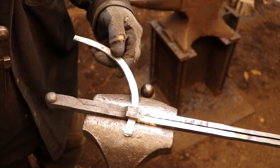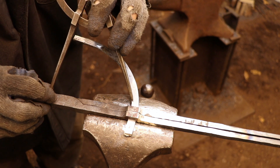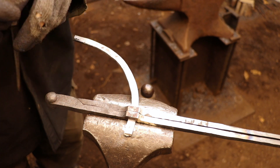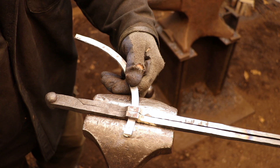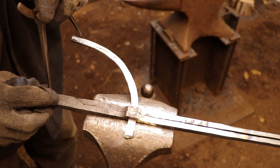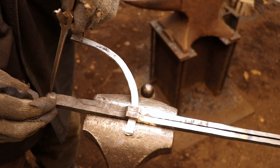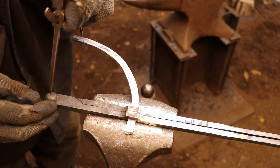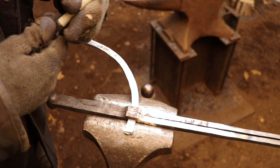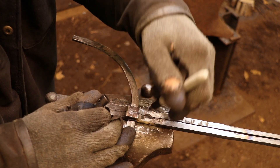So here I'm a little bit further along. I have the curved section so it fits inside the dividers, but now I need to make sure that it's in the correct location. I have a smaller set of dividers set from the exact center of the pivot point to the exact center of the center line of this curved section. If the curved section is in the correct location, this set of dividers, as I swing it out, should follow the center line exactly. If the dividers drift off of the center line of the curved section, then I need to move the curved section over so that it aligns up. Once I have these two arcs matching up perfectly, I'm going to use a sharpie to mark the exact location of where this curved section needs to be.